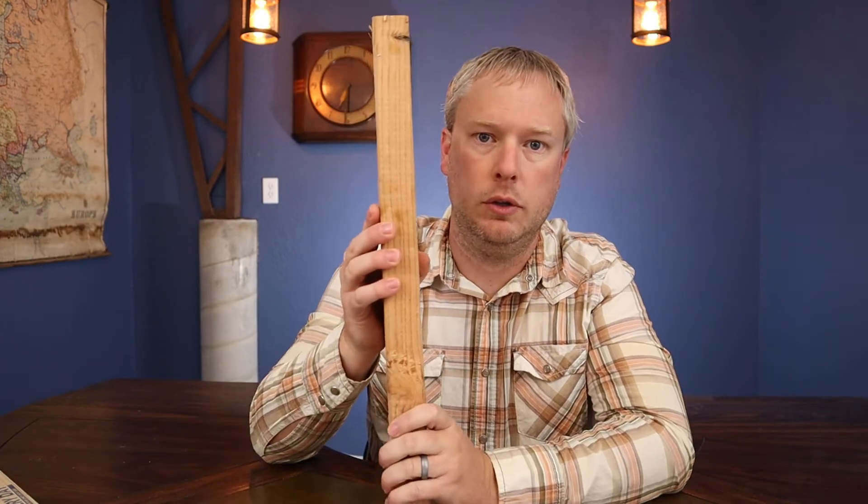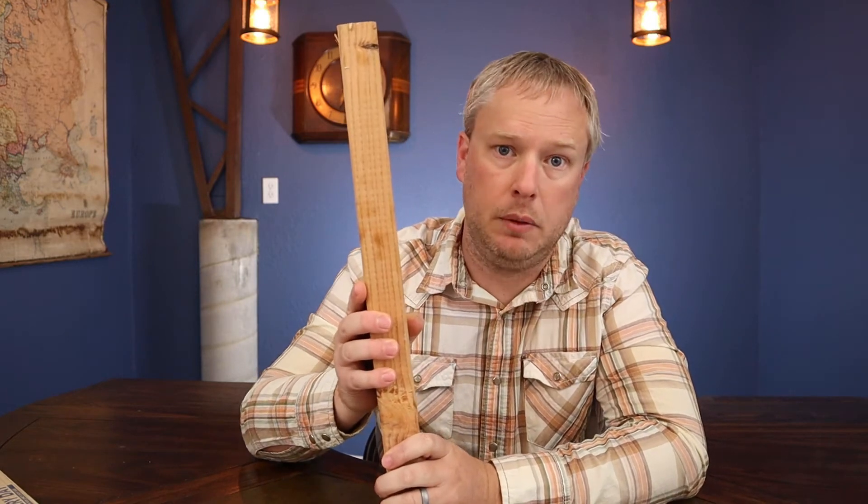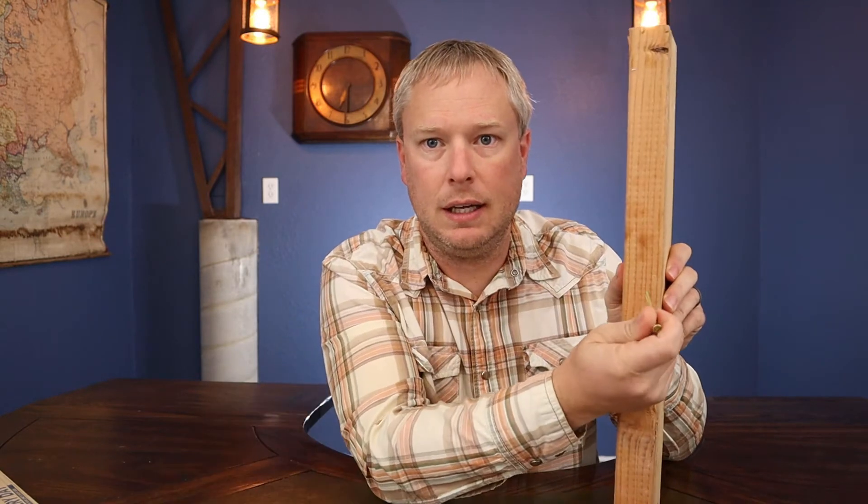Most likely the web you have is an inch and a half thick, just like a normal two-by-four. Now this sounds great, but the problem is — let me demonstrate. When you hit a stud, you generally want to try to hit it right in the middle. But if you hit it a little bit off center or near the edge, it usually has enough strength to hold. That's not the case with plastic webs. Take this stir stick for example — it's actually thicker than these webs but gives a good indication of what's going to happen. If you put a screw into this stir stick towards the outside quarter inch, most likely the wood on that side is going to bulge out or break. The same thing happens with the plastic webs, except they don't generally bulge — they just break off.